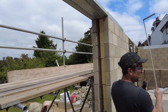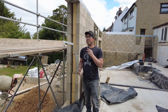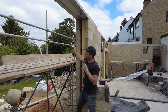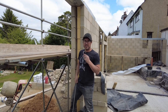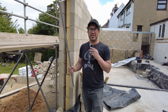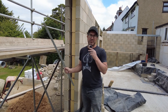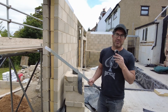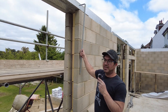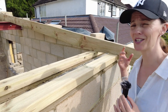Not a lot of builders do it in the cavity — that's primarily because you'd need a bricklayer and then a roofer. The question is whether the right way is doing it in the cavity or on the outside. What we had to do was put it on the outside wall. We talked to our structural engineer — he'd never seen it done before — and also to our independent building control, London Building Control, who agreed it was absolutely fine as long as the lateral strap is protected from the weather. These are galvanized steel so they shouldn't rust, and they'll be clad in, so that's absolutely fine. Most importantly: it's safe and structurally sound, and from a design point of view these straps won't be visible on the inside. We also have to use stainless steel screws so they don't rust.